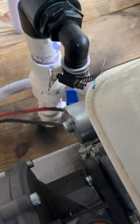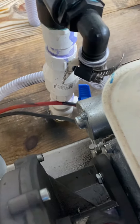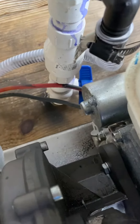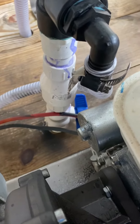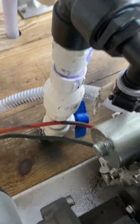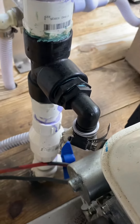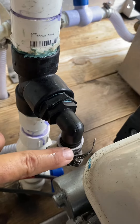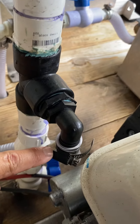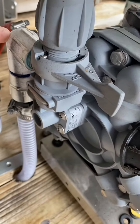This is my main water line coming out of the bottom of the trailer. Put a cutoff there, then come above that — this is one-inch line. Do a one-inch check valve for your water, come up, and put a T, reduce down to three-quarter inch. This is your bypass line — you need 25 foot of it. It runs under my trailer and comes back in right here at the pump.